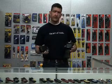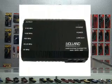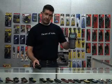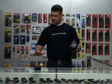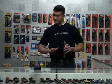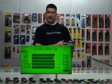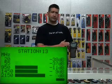The last feature, which is my personal favorite, is the sweep. It has a transmitter, which is also included. This transmitter sends out five frequencies from 20 megahertz all the way up to 2.1 gigs. The receiver unit will show you how much loss there is between the transmitter and the receiver. This is fantastic whether you're doing residential or commercial — let's say you're doing a school and you want to find out if your distribution system is working properly before you put signal on it. You could put the transmitter outside where the cable comes in and take the receiver unit anywhere in the system — test ports, taps, wall plates, wherever — and it'll show you how much loss there is between the signal coming into the building and the receiver.